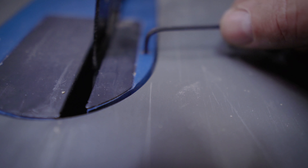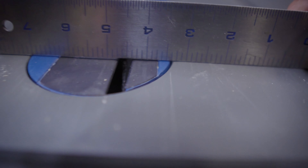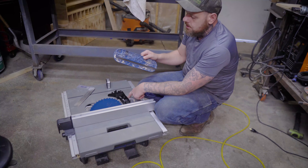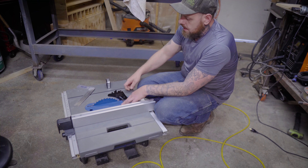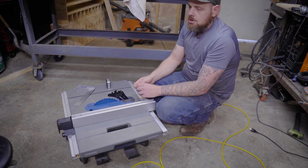If there are gaps, it's really simple to adjust. It is a socket head screw, so you'll need an allen key or allen socket. All I'm using is a small bag of allen keys. When you tighten the set screw it raises the throat plate up, and when you loosen it it brings it down. If you look on the bottom you can see where the set screws come in — they press the throat plate into the tabs on the saw to either raise or lower it.